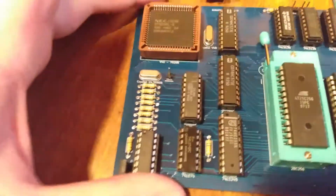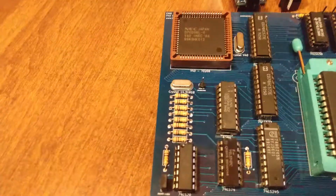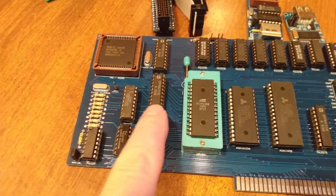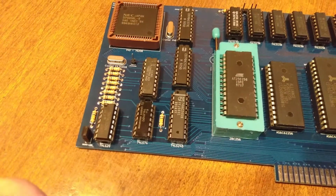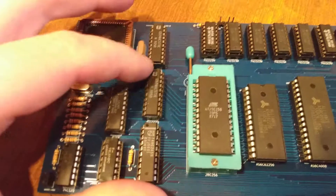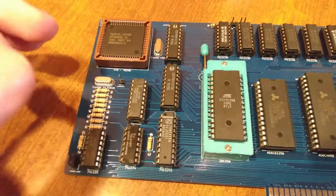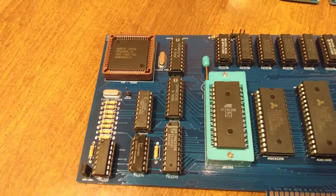There's a pin here used with the serial port — it's like a serial ready, but it's also got a couple other things on there. Now, off the V40, it's like the 8088 where your data bus and your address bus are on the same pin. So you have to come out here with this transceiver, the 245 — it's an HC but the LS245. Then you've got some latches here. The original used LS373; I use a 573. The only difference I can tell is these are in parallel where the 373 alternates in and out. So it's just a straight-across parallel latch.